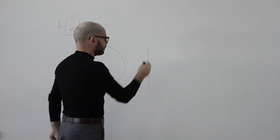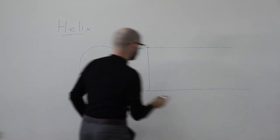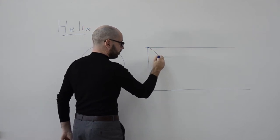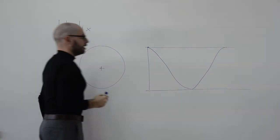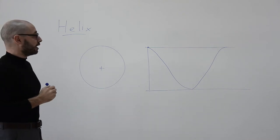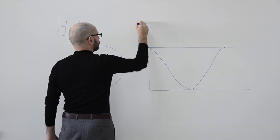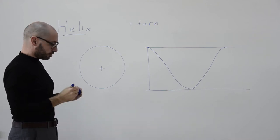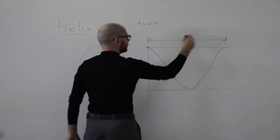If I had to draw this, the marker is going down but also moving forward, still going down, and then it starts going up — and it forms a helix. Excuse my freehand, but that would be the shape of one revolution, one turn of a helix. This helix is made up of one turn because we turned the ruler for one revolution. The distance walked from start to end is called the lead.